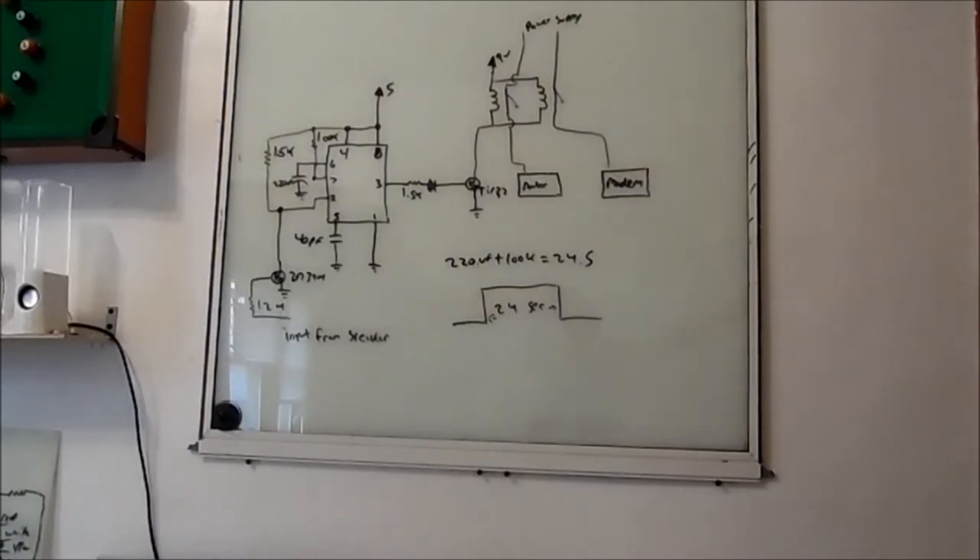The reason I got the idea from this fan is that I wanted to take it apart and see how it worked. It was actually broken — our dog knocked it over and broke one of the blades. I tried incorporating this idea into it, but the circuit I made wouldn't cooperate. I tried controlling two buttons on the board with a high and low pulse using transistors, but it just would not work. Also, it operated on infrared, which is not efficient for long distances, so it only would have worked from my couch.